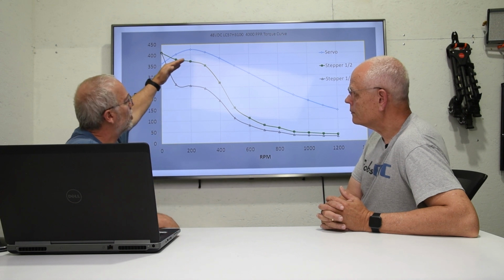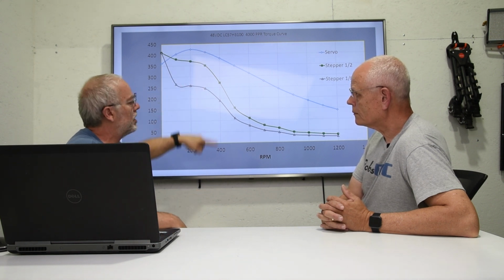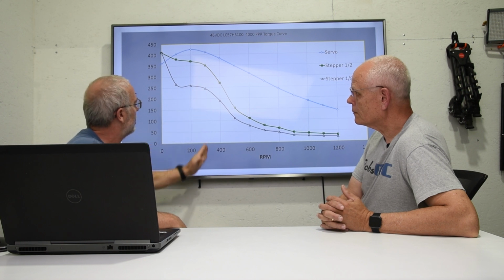That's moving pretty good. We actually tested our machine at 1,500 inches a minute, and it will work, but your processor might not be able to keep up with a lot of the little moves. Okay? So if I have a stepper motor, that's why stepper motor systems are a lot slower than servo systems, because you have to design within the torque limit that you have. So you're going to be down here somewhere in the 300 to 400 RPM range, right, which is going to calculate to a lower feed rate.